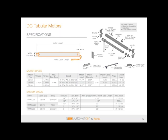You need to consider the weight bar that you're using in your shade or any weights that you're using in a drapery and any product that you're putting on the back of the shade. Everything that you are using in that shade or drapery needs to be weighed and written down, and then you add all of that up and you're going to come up with a very close estimate for what that is going to weigh.